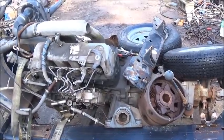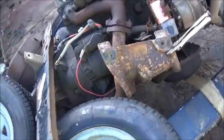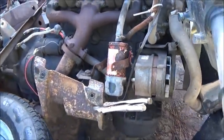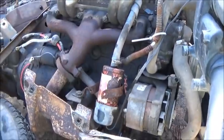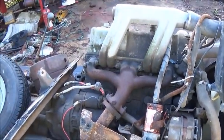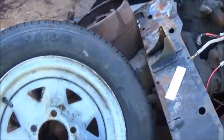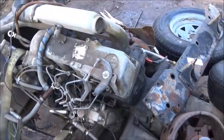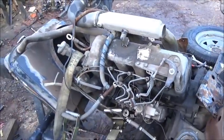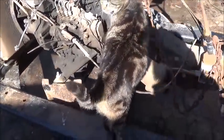We need to get it mounted down, radiator mounted, fuel tank, and a battery of course. The alternator on this — I'll probably have to change to a GM unless I can figure out how to wire this one; I don't even know if it's an internal regulator. We've got three wires total coming from it — we might configure that out, which is pretty simple. A GM will probably mount right in place. We're going to do away with a few things we don't need, like the 1500-watt water heater that's in line with the heater hoses. We'll run the bare minimum — put a little panel on it with switches, a key switch and a push button. You need a key switch because you don't want power going to your alternator all the time or it'll run the battery dead.